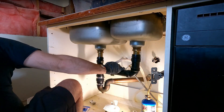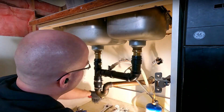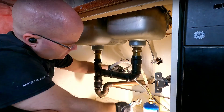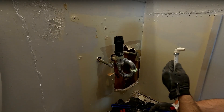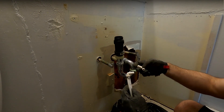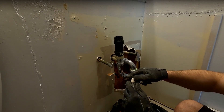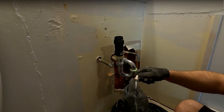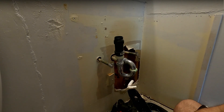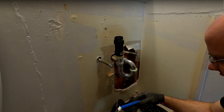I definitely cheaped out a bit with that valve, but it's still brand new and works perfectly. In a condo that will max out at $250,000 at sale, saving 20 bucks here and there is a pretty good plan. If you've never used PEX before, this isn't a crash course, but it gives you an idea of how easy it is. You take your fitting, put it in — it's got little tabs, make sure the pipe goes all the way up to the tabs, put the ring on up to the tabs, and then clamp it. I like clamps versus crimps because they're cheaper and get into tighter spaces.